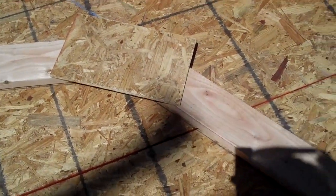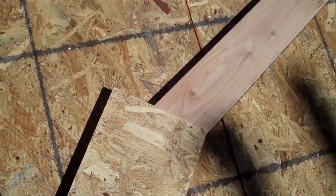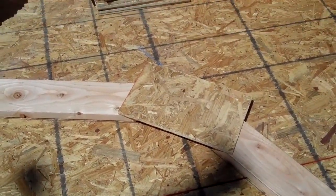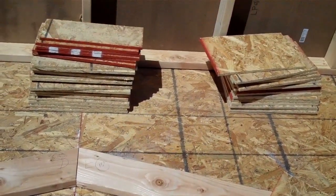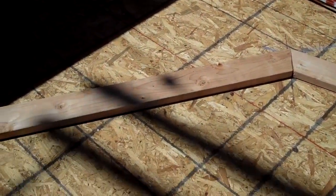Take these truss plates — I've got them cut out at 16 by 10 inches. Lay them on there, staple the crap out of them in place, then run your saw to trim them if needed, or cut them to fit beforehand. Then flip the whole truss over, put plates on the other side, staple them again, and before you know it you've got trusses.